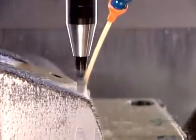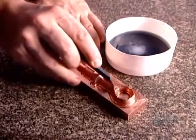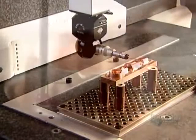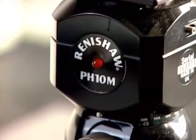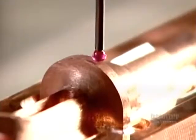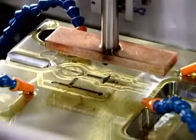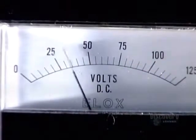From here, most mold components go onto a second tooling machine, especially if they have fine detailing that the CNC can't carve. The second machine is outfitted with a copper electrode in the shape of the plastic part — in this case a snowmobile oil gauge. After polishing the electrode to ensure flawless casting, they use a sophisticated measuring device to verify the dimensions. The electrode goes face down on the second tooling machine, called the EDM.